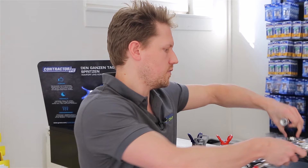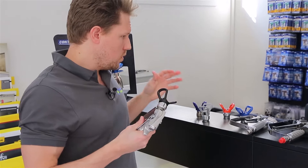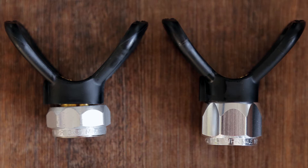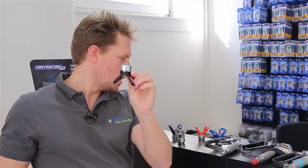The Graco FTX gun also accepts a Wagner spray guard — there's quite a lot of interchangeability. You really won't have an issue with what type of spray guard you're using with any of the current models, and even some older ones will work fine. There is a 11/16-inch spray guard from Wagner that's not as common anymore — it will be slightly shorter than the 7/8-inch one, and since they're both black you can only tell by length.